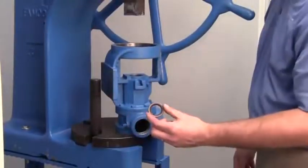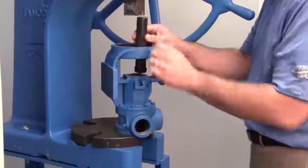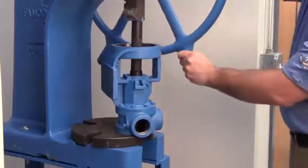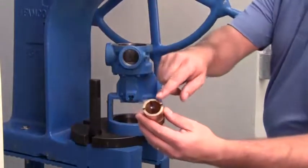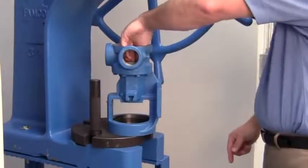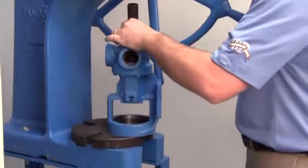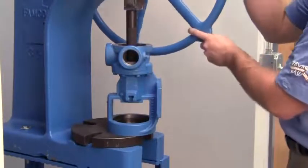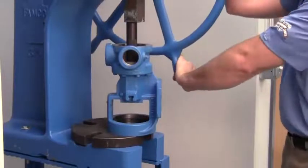Install the lip seal into the bracket. Install the bushing into the bracket. Bushings with lubrication grooves should be installed with the groove at the top or 12 o'clock position. Carbon graphite bushings require extreme care to avoid breaking the bushing during installation. For carbon graphite bushings, use a lubricant and make certain that the bushing is started straight. Use a press to completely install the bushing in one continuous motion. Starting and stopping will crack the bushing. Make sure slots in the face of the bushing are towards the rotor end of the bracket.